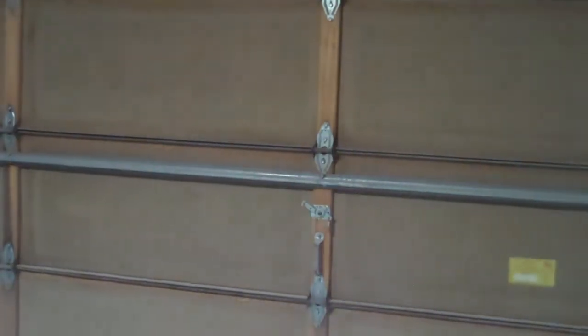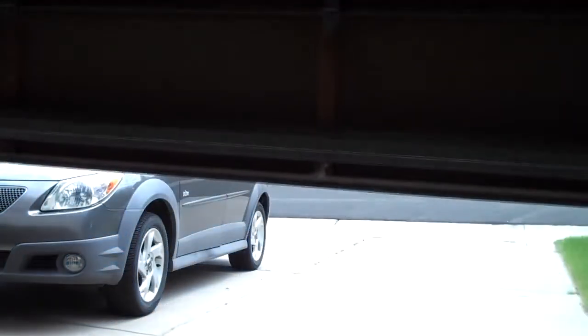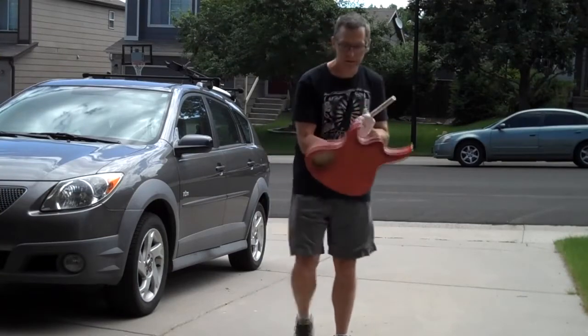As soon as I finish scraping it off, I'll take it out into the sun for 60 seconds until it's bone dry. Then I'll bring it back inside and repeat the process up to 4 times until I have the grain completely filled and the surface thoroughly sealed.